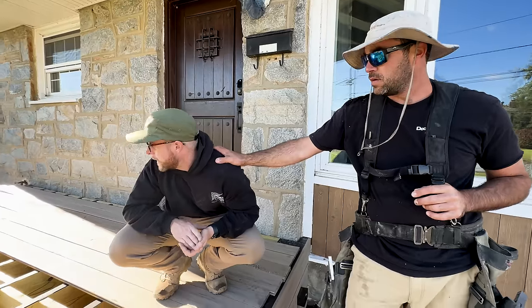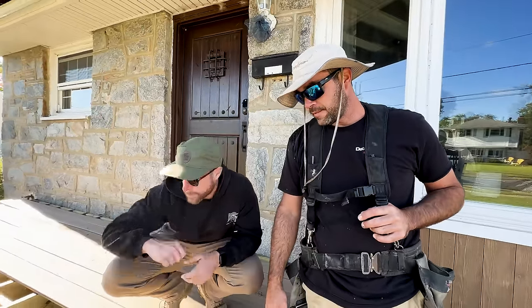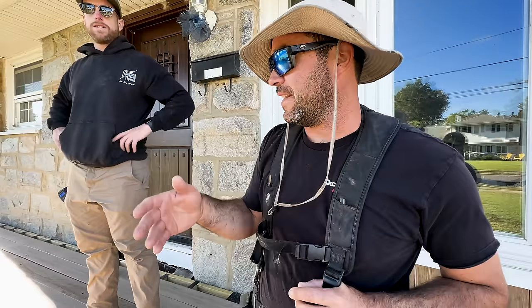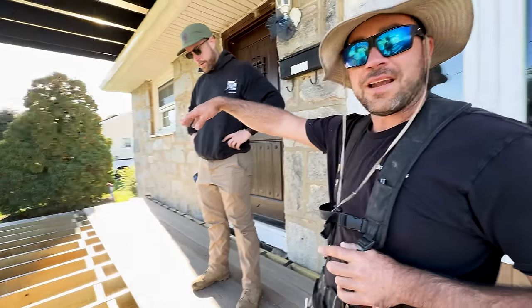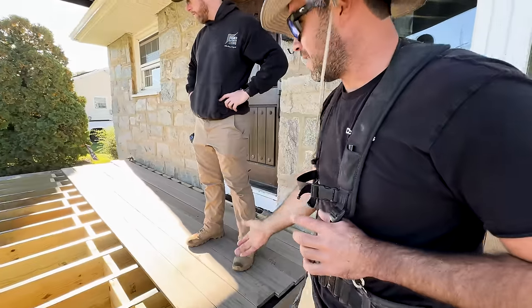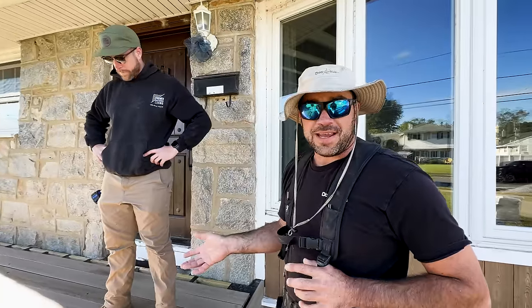Anyway, we're going to knock this out so that you're in good shape, and walk us through what we got going on with the deck here, how we prepped for this, and what we got. So we got a pretty standard deck here. I think it's about 8 feet by 14 feet. 2x10 joists, solid blocking for our picture frame, planed flat with a planer, tape to protect it, and then Deckorators decking on top. I like to get as many field boards down as I can.